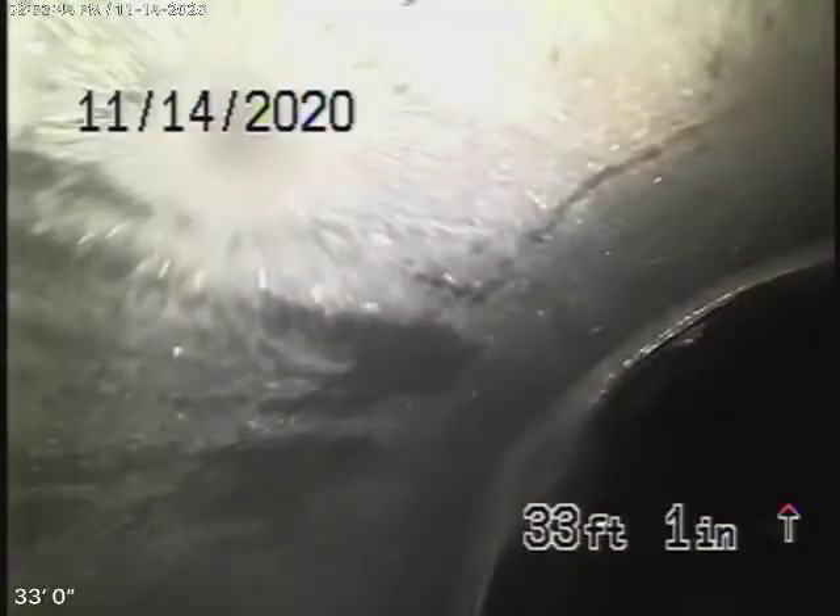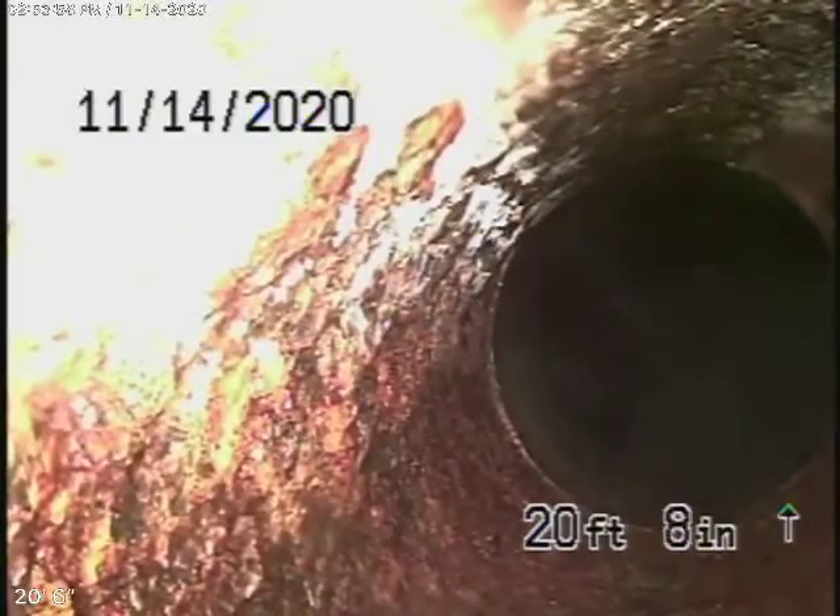There's the other clean-out. That's the other clean-out outside where the pipe exits the house. It then comes underneath the house where there's a bathroom — it was probably added on at some stage. And then it comes to cast iron pipe. You can see it — very minor rust build-up now that we've gone ahead and descaled the pipe.